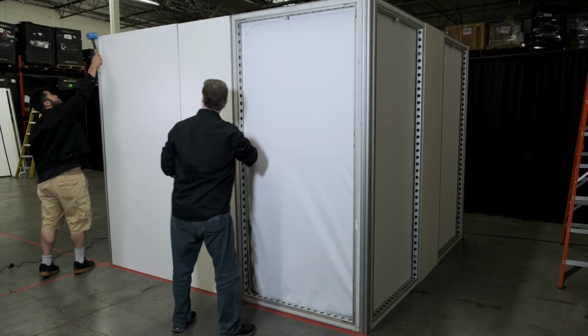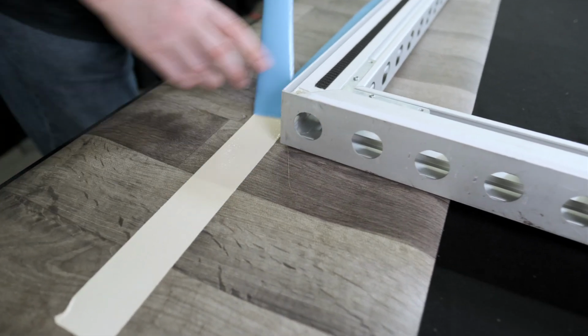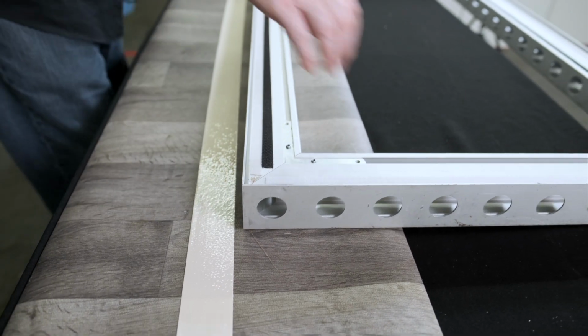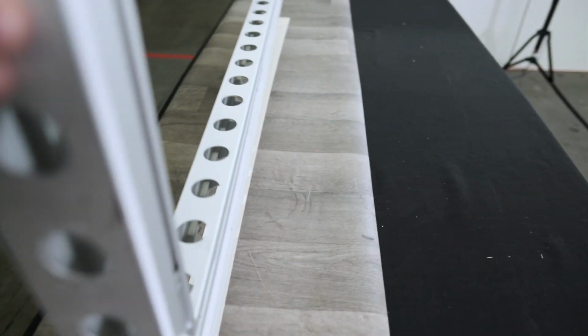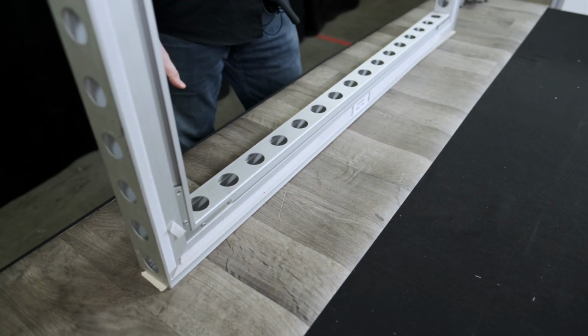The room itself would be mounted or assembled on top of a vinyl floor. And the reason for that is, one, so that you have a cleanable surface if you're setting up in a ballroom or a gymnasium or a convention center where you have concrete, but also the vinyl floor can have a double-face tape, carpet tape, that will go around the perimeter where the wall gets set up, and it creates a seal so that you can have basically a secure, isolated room to keep out any virus or to keep a patient free from any kind of infectious diseases from the outside.